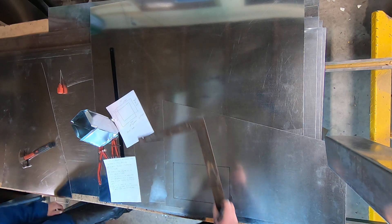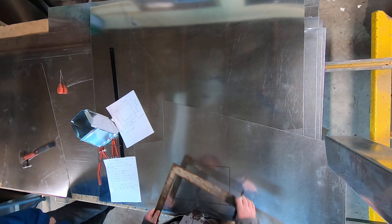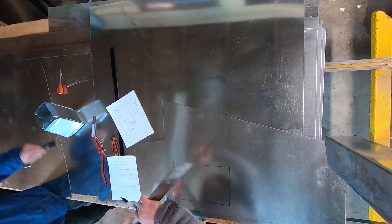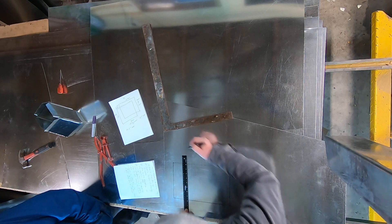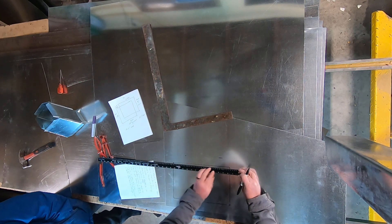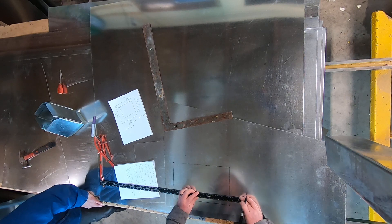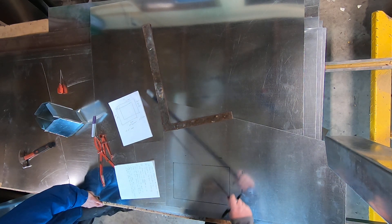Then I'm going to draw my duct to scale with my offsets. This 9-inch side is going to be 1.75 inches off from here, so I'm going to go 1.75 inches up on each side. Then here it's 2.5 inches over, so I'm going to go 2.5 inches over here — this is off of a square plane — and 2.5 inches over here as well.